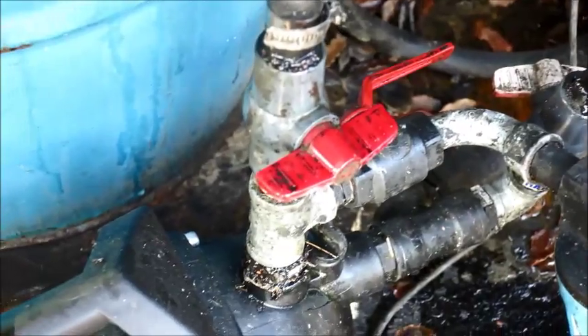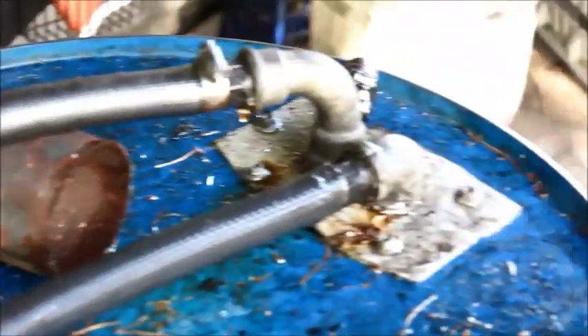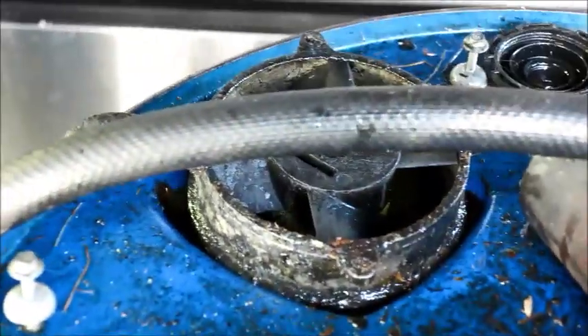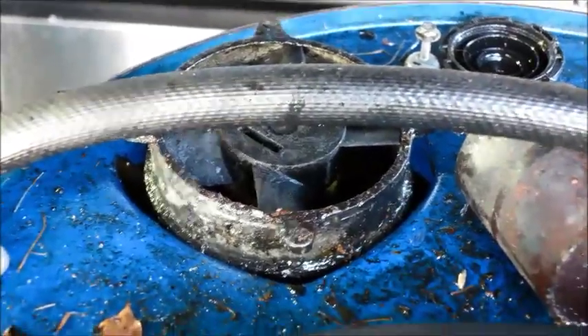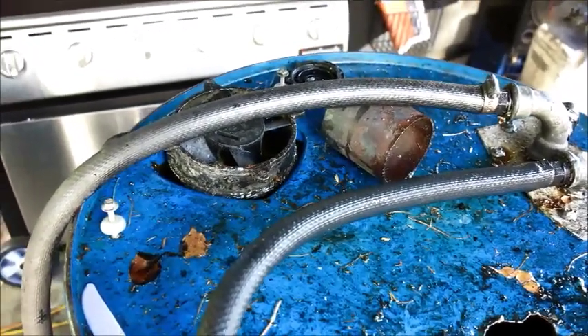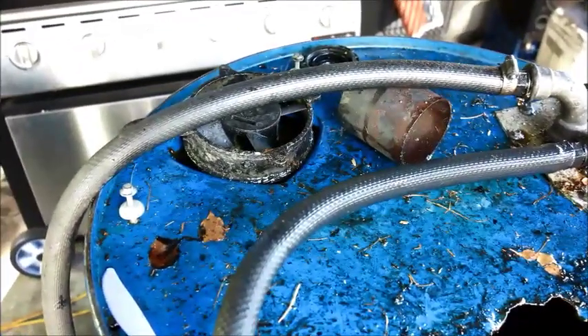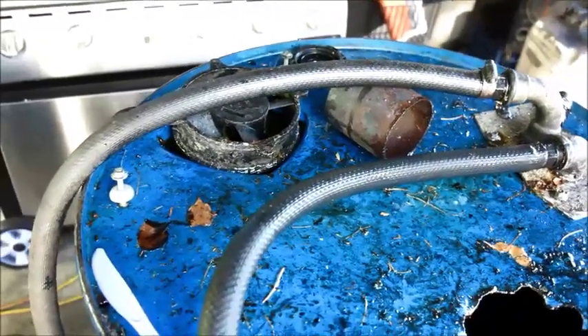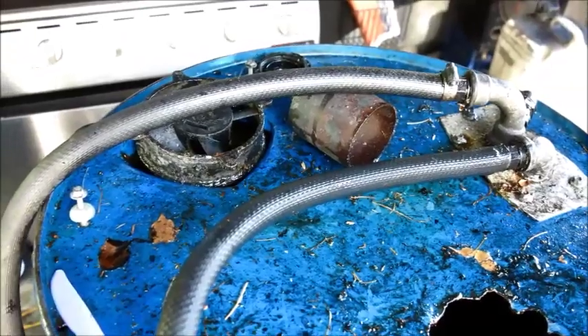One side is just the return — that goes up through the hose and onto the top. I cut a hole there for the two returns. There's another hole I use for filling and as an air inlet, and there's a small fan there that sucks the air through the smaller hole, through the drum, and then exhausts it. I found that if I reversed the fan and blew the air in, it didn't work nearly as well — the drying took a lot longer. Perhaps it's actually pushing moisture into the oil instead of pulling it out. Having the fan suck the air out works much better.